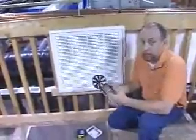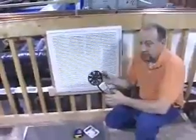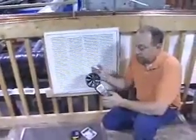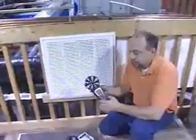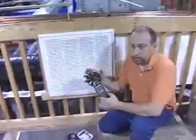Today I'm going to show you how we measure airflow on a single return air grill or double return air grill system using a vane anemometer. A vane anemometer is probably the best tool to use for this job because it doesn't require any density correction. It takes a direct measurement of flow, so there's no indirect measurement made and it's going to give us very accurate results.